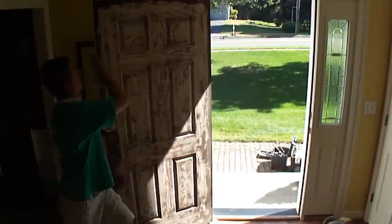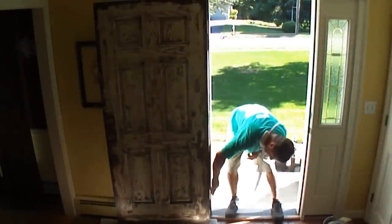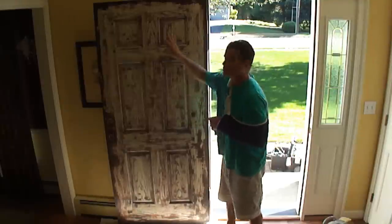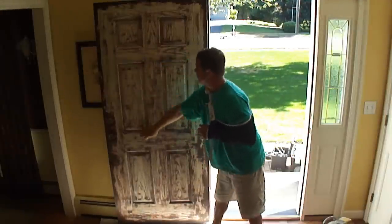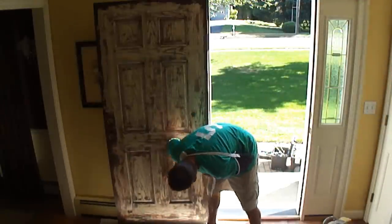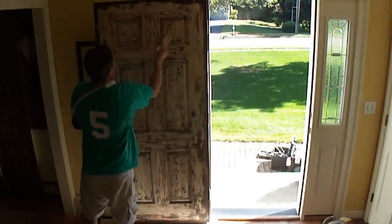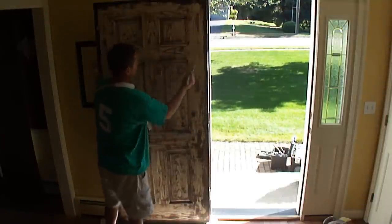Get this edge here and then this edge right over here — I know it's hard to see. You definitely want to use a mask. After you sand, just go around with your fingers and try to feel for areas that you may have missed with the sandpaper. So once that's done, I'm going to put the sandpaper down and get my dust brush and dust away the surface here — or you can use a vacuum too. The brush is able to get into all the corners, so that's why I like to use a brush.